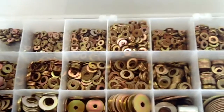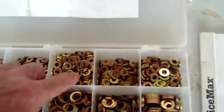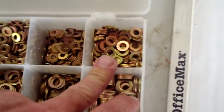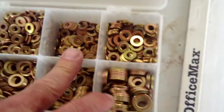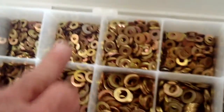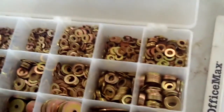They come in a variety of sizes. We have this big bin that we bought from a supplier years ago, and we keep it stocked full with all the hardware we need. The only thing different is when you get below the number of the AN-4 bolts, you get into the AN-3s, and that's dash-10 hardware. So this is a 10L, a 10, an 8, a 6, and a 4 — they come in a wide variety of sizes.